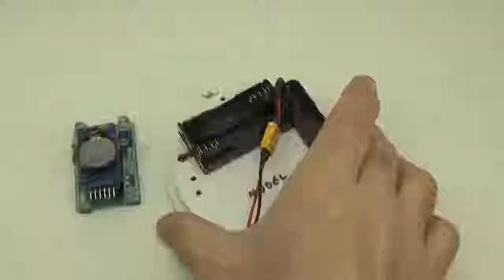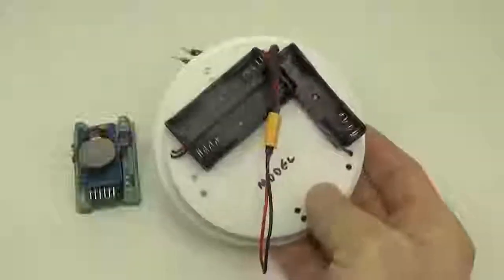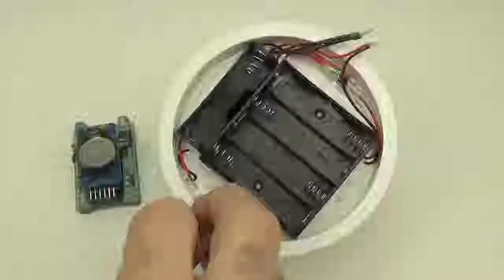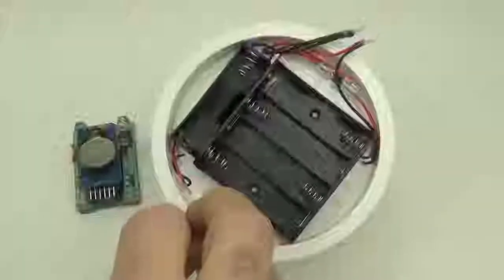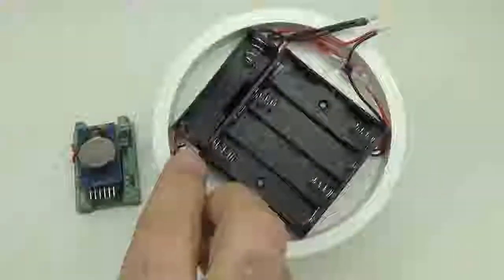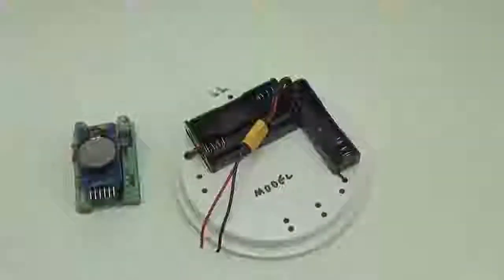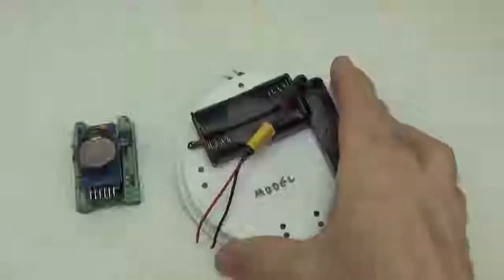and you can see I've got model written there because I always keep one handy just to remind myself how to build them. This is for a 2x4 AA bank of batteries, and I like having two banks of batteries, both for backup in case one set of cells fails, but also for units that draw a lot more power. And I think you said yours was going to run on 2 banks of 4, yeah. 2 banks of 4 because you've got the Atlas conductivity board, and the conductivity boards always draw a lot of power, so having a second set of batteries is really nice.